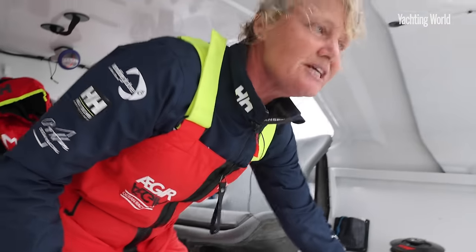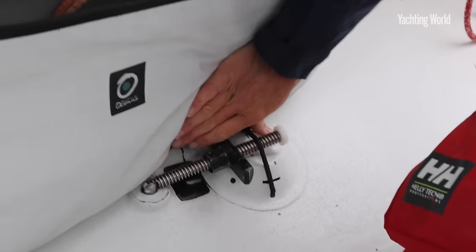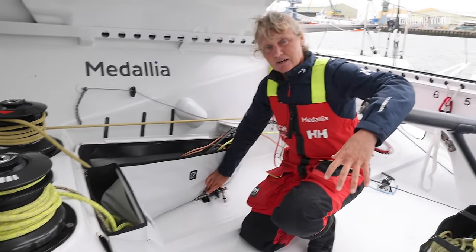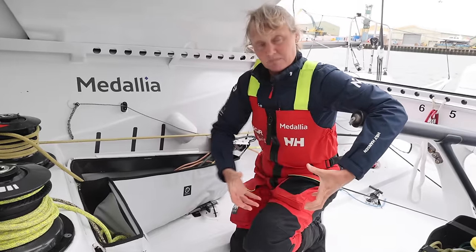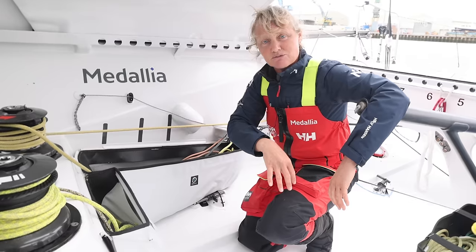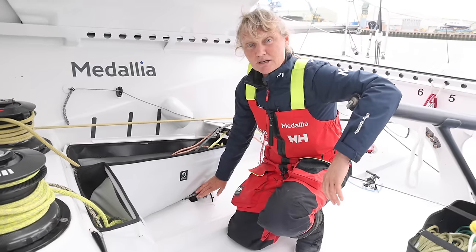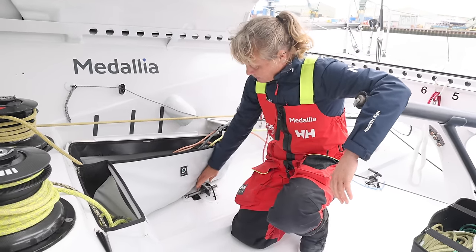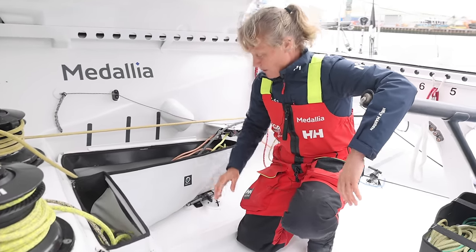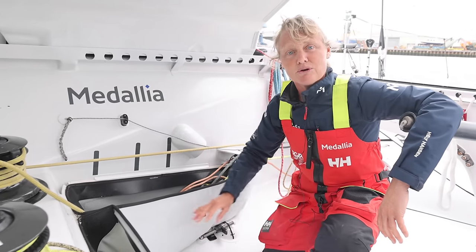The other thing of interest in the cockpit is down here. This scoop is for the hydro generator. They're internal. So the scoops go down, there are big tubes inside the boat, and rather than having the traditional outboard leg that sits off the back of the boat, we've got the hydrogenerators inside. I need to be doing over 15 knots for these to work. And then when I get up to 20 knots, I have to start regulating them, which is why this bar here is threaded. So I will gently start pulling the scoop up so that less water goes through so that I can regulate the amount of power that the hydrogenerator is producing.